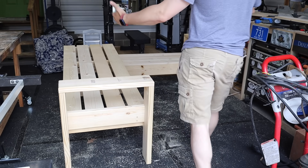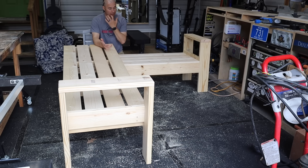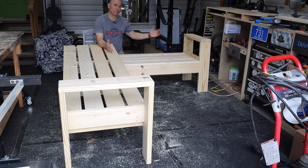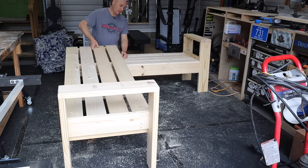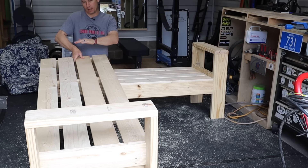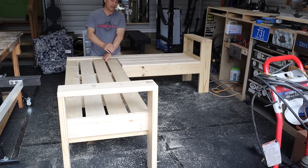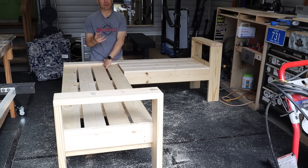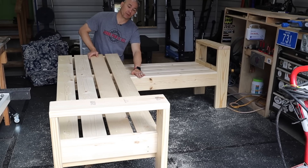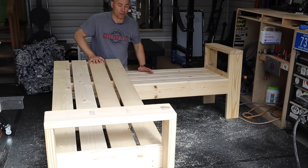Right before we start building the back, we're building an angle back and we want to go ahead and join this together, even though it's going to be extremely hard to move. If you're building this as a modular piece, you would leave these separate at this point and then build your backs to attach to the base separately. What we're going to do is glue and screw from this sideboard into this, and then from this piece into this. There are legs on the backside to support the back. The middle corner shouldn't need a leg because it's all tied together. If you want to make this two piece, just put a leg on the corner and it would be moveable separately.